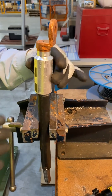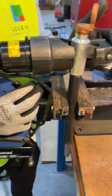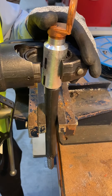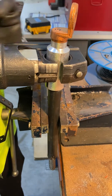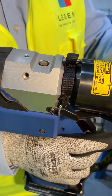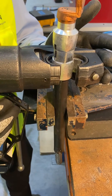The black lines found on some lugs indicate the position of the crimp. Position the crimper and line up the die with the black line closest to the palm of the lug. You always do your first crimp at the palm end of the lug and work down towards the barrel end. Squeeze the trigger until the desired pressure is achieved, at which point you will hear and see the crimp indicator click up and the die will automatically release.